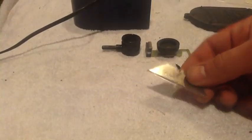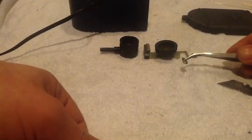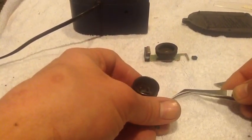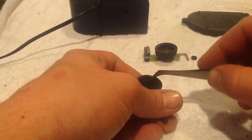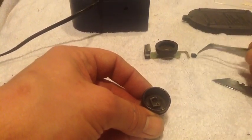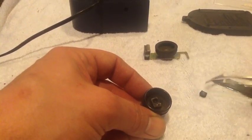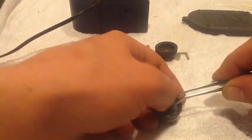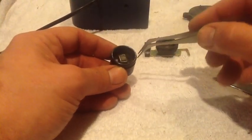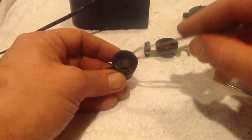My first solution to making a new gasket was to find some rubber — where can you find it? Well, if you've got an old shoe, even a good shoe, I just took my razor and cut a thin little slice off the bottom of my shoe. That's where tweezers come in handy. I didn't cut it to the exact shape of the previous gasket, but just as long as you can get it to cover the hole and have a piece on the inside where you'll put your other little rubber stopper to hold it in place. I got black sole on the black air cylinder so it's hard to see, but just get it in there to cover up the hole.